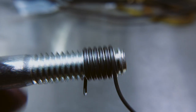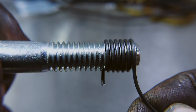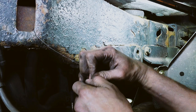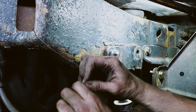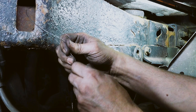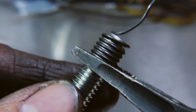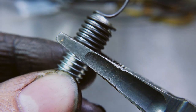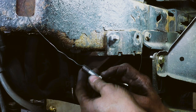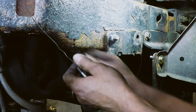That's what you're going to create — don't spin the bolt, it creates like a helicoil effect. Fold the wire over and get it to the center so it's like that. For the little tail you have, just take a pair of pliers — I'm using my welder helper pliers — and make it flush with the bolt. Generally don't put a washer on these, because how we're going to tighten this is with an impact gun and force, and that allows it to slip.